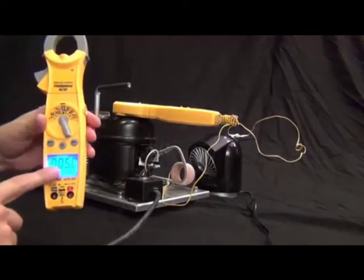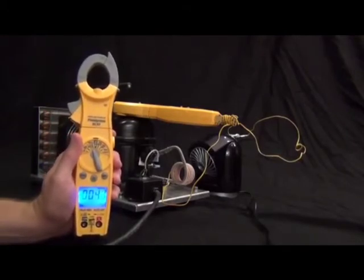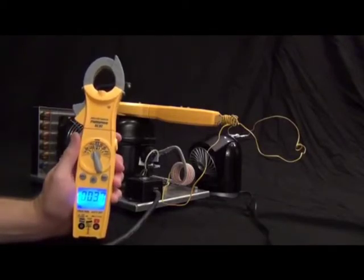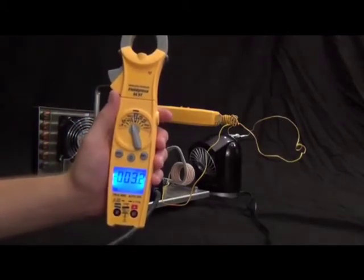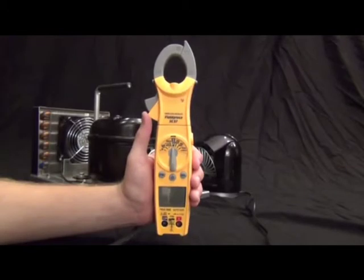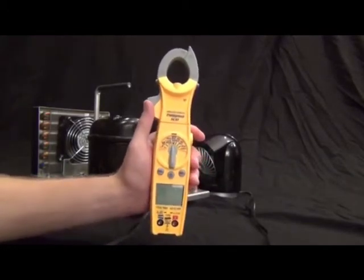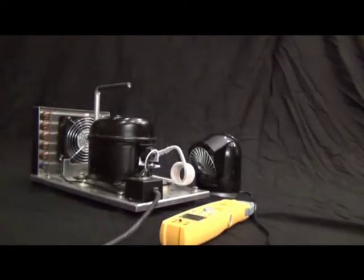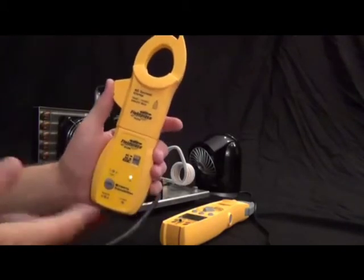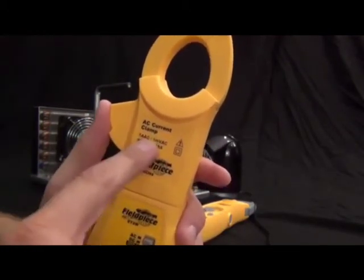Another great application is getting wireless amperage — mainly to measure amperage on your blower while the door is closed, since you need the door closed for accurate amp draws. I can take the Fieldpiece amp clamp accessory head, attach it to the transmitter, and send the signal wirelessly. This one is the AC amperage head — the label says volts AC, so set it to AC mode. Clamp it around a wire; in this case around the compressor wire. Turn on the meter and it remembers the accessory head from the first sync — currently reading about 1.2 amps.